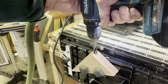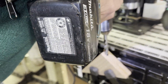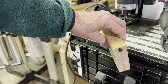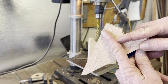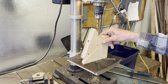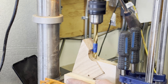After you drill all the way through, there'll be a little bit of shaping to do on the block using regular Shaper Origin procedures — the files are all included in that project. After you've shaped the block, you'll take it over to the drill press using the same alignment jig and line it up to drill the hole for a threaded insert. The threaded insert will be used to keep the pen in place in the pen slot, perpendicular to it. I'm setting it up using the alignment jig on the drill press to drill the pilot hole, going all the way through to the pen slot but not further — I've just got a depth gauge mark.